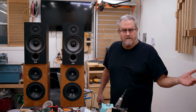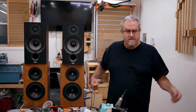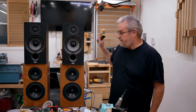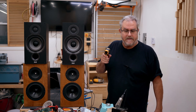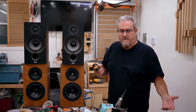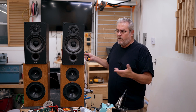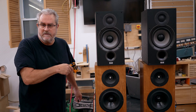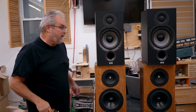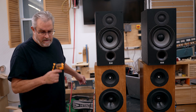The shop is not overly hot — it never really gets hot in here, even in summer. It's 20 degrees Celsius. I've got my kitchen thermometer set to Celsius to get a reading on the heat sinks, and I'm pointing it directly at the output transistors. Those never go above 30 degrees Celsius under idle or under this load. I turned the amp off about an hour ago but left the music playing in a continuous loop on my laptop. So, just to show there's no trickery, I'm going to switch the amp back on and you'll hear what's coming out of the speakers.